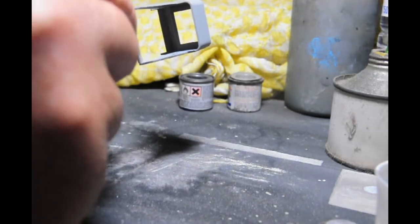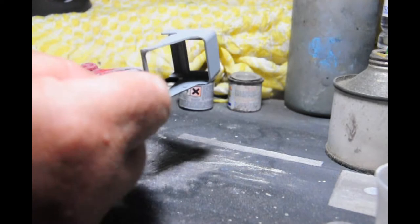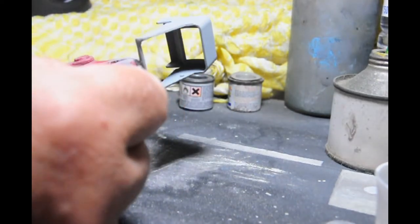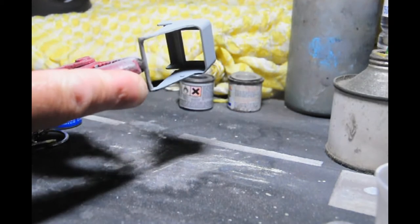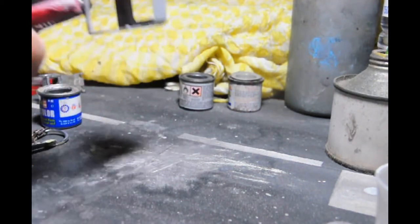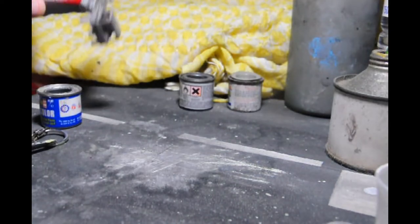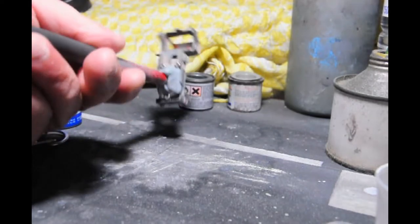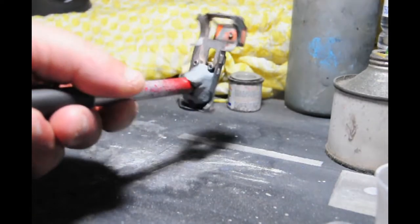and put a little bit of brass rod in the middle and then super glued it and baking sodaed it. Then super glued and baking sodaed it back onto the tilting back mechanism. I've already done the drilling and tapping, as can be probably seen on this bit.